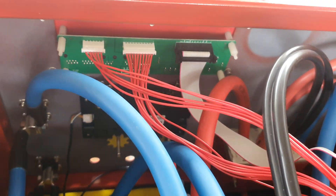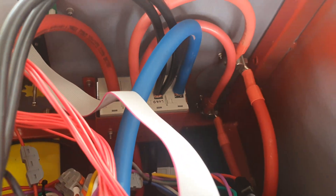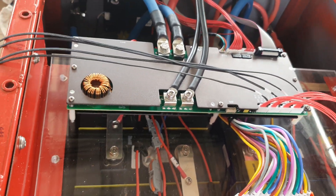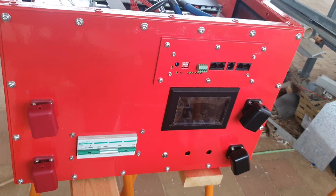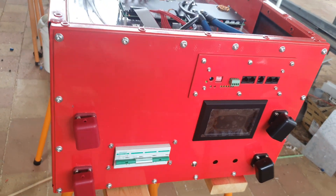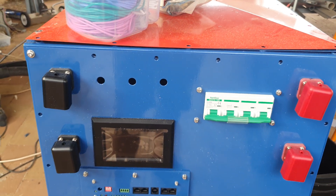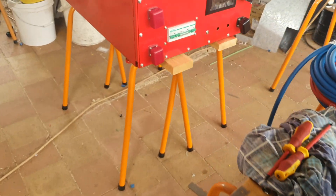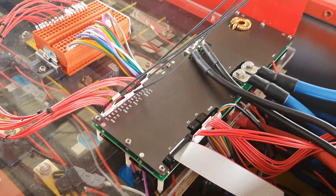Originally I had the front plate up the other way, with the BMS cables going in diagonally opposite down into the bottom end. But because of the BMS, the length of cable from the red cable wasn't long enough, so I've had to invert the front plate. That's actually how it ended up being. If you look at this other one, I'm yet to change it — the display is up the other way — but it's just a matter of unbolting the screws, turning it around a little bit, doing a little bit of filing, and Bob's your uncle.